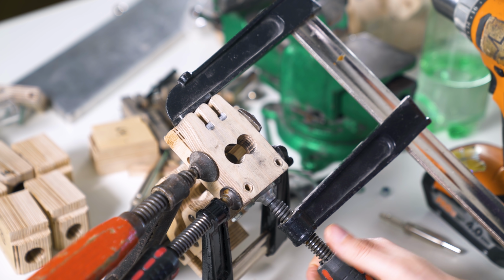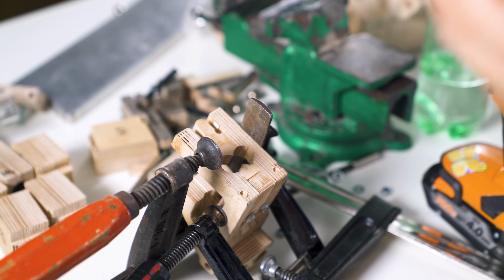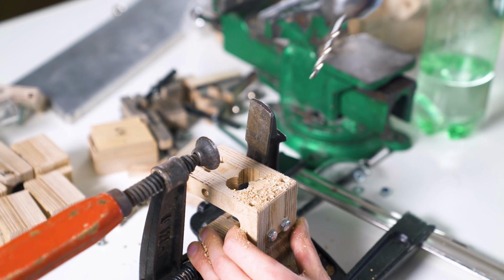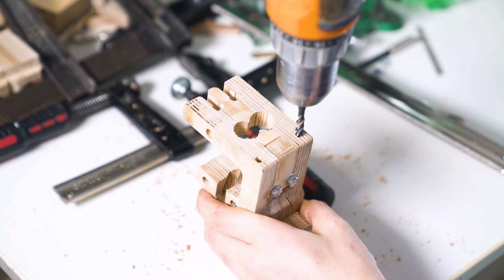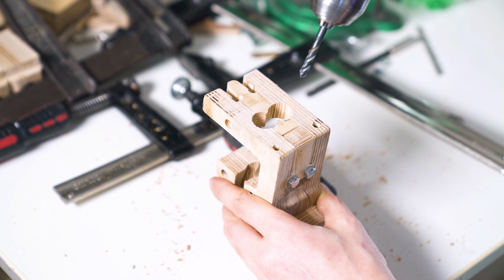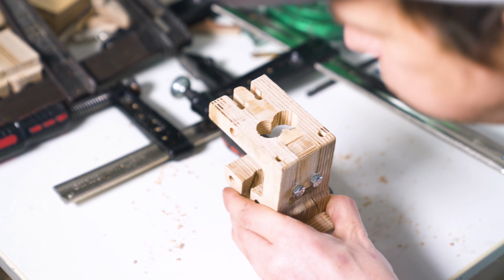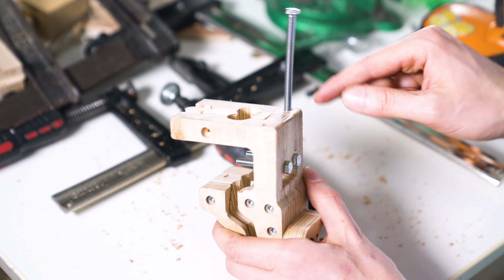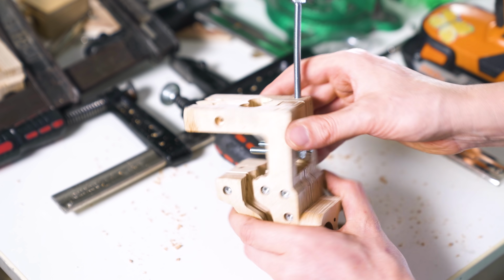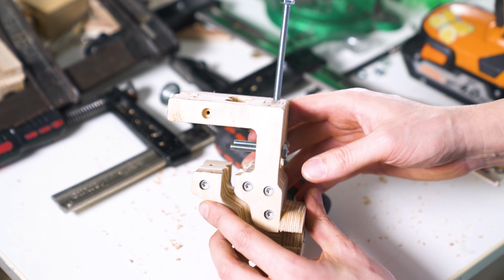So now we should have our divots. Then in the divots, I'm using a smaller drill, 5mm. And lastly, an M6 tap. This does work in plywood. I should correct myself. This works in high quality BB grade birch plywood. The construction plywood you're used to through the construction stores is not comparable to this material.